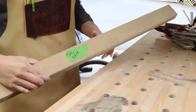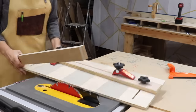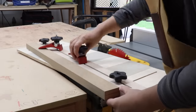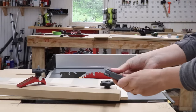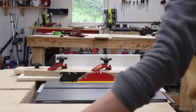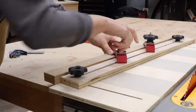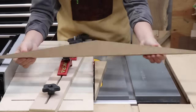The tail ramp is all dry and it's time to cut it. I'm going to use the taper jig again — I already have those lines marked. All you have to do is line up the cut line onto the bottom of the jig and clamp it into place. Since I had to remove the stop lock on the back, I set my square to that distance so I could repeat the cut on the other side: one cut, flip the piece over, match the position using my square, clamp it down, and cut the other side. Making this tail ramp was actually the most difficult part of the jig — the rest was smooth sailing.